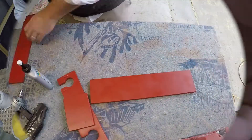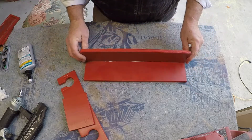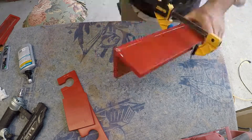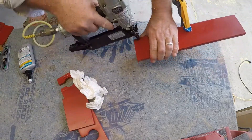I taped off the lettering part and then spray painted all the exposed sides. I'm going to use some Titebond quick set glue — this is one of my favorite glues I use, and I'm not sponsored by them. Then I'm going to use some three-quarter inch brad nails and nail it together.